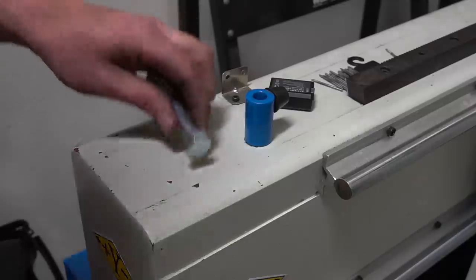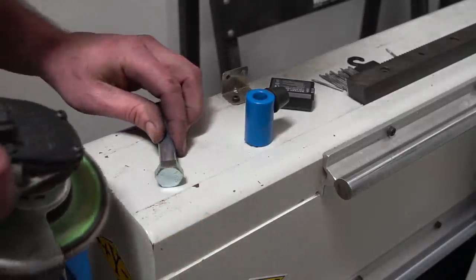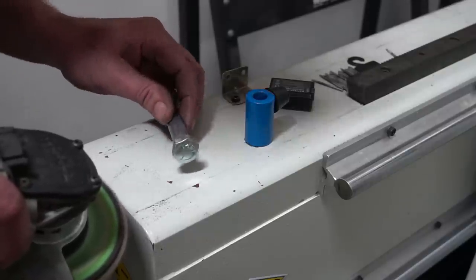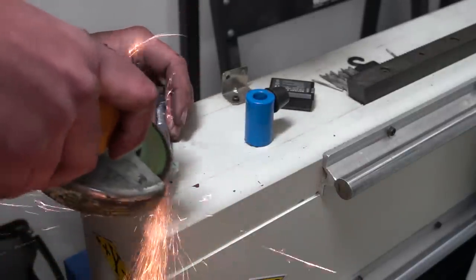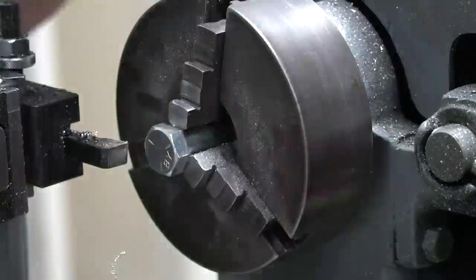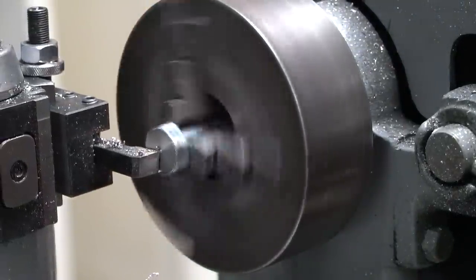We're not going to keep these poly bushings. We need to make a jig. To make a jig, we're just going to take a couple of bolts the correct size - one a five-eighths, the other a nine-sixteenths - and I'm going to remove the zinc coating by grinding it off on just two sides. It doesn't need to be super heavy duty. It's just enough to basically hold the place, and that's all a jig does.